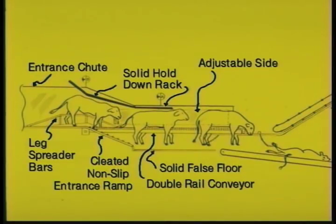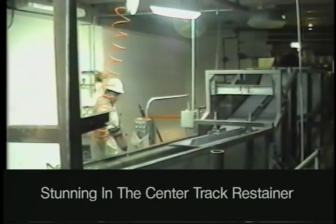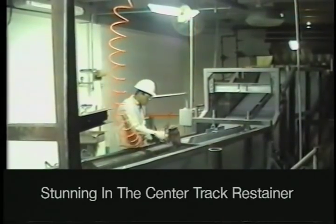This is a side view drawing of a conveyor restrainer system that I designed. A big piece of equipment like this is appropriate in plants that slaughter over a hundred cattle per hour. Under a hundred per hour you can do a good job with a stunning box or a box-like restraint device, but over a hundred an hour you're pushing it too fast. The cattle straddle and ride along on a conveyor. Notice there's a solid hold-down over the top of the cattle — it blocks their vision so they don't see people. An animal entering this conveyor has got to have his back feet off the entrance ramp before you let them see out. A two-foot difference in the length of that hold-down is the difference between calm cattle and cattle going berserk. Details of design are extremely important.